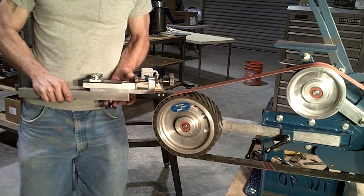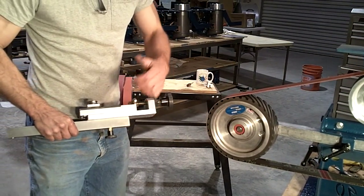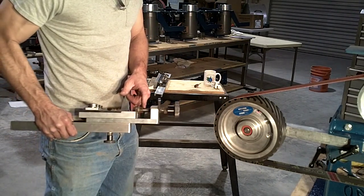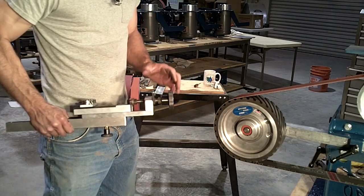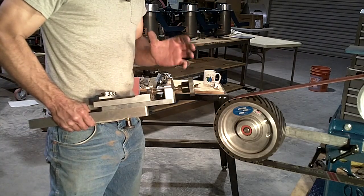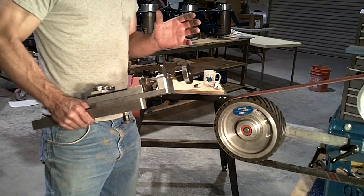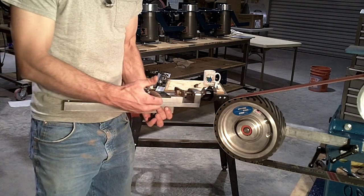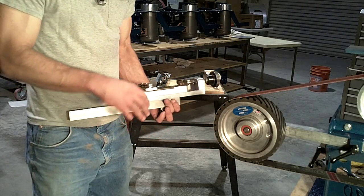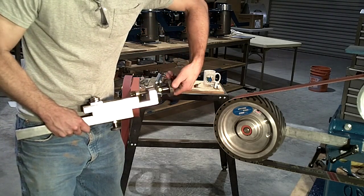Here's the first part of the surface grinding attachment — there are really only two pieces. This is a slide and it's for your fine adjustment. Your lead screw here is actually a ½ inch fine thread, or a piece of all-thread. I tried to design everything so that anything that could possibly wear out is a commonly, readily available part — everything from the main x-axis slide to the hardware that goes together. So you have your fine adjustment right here.